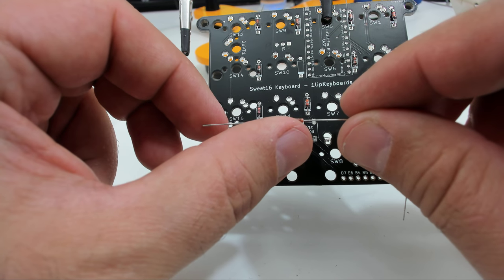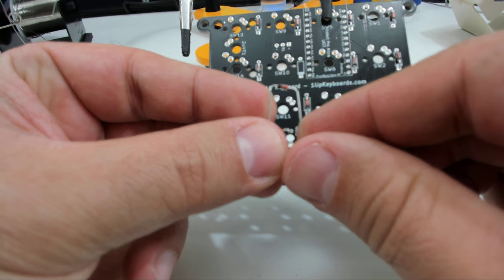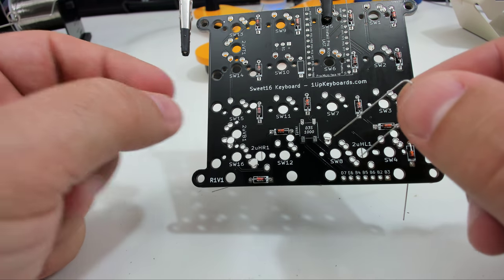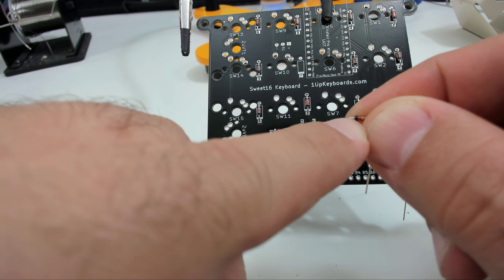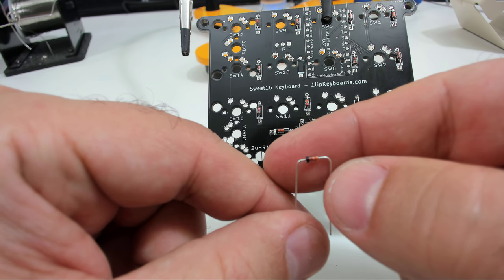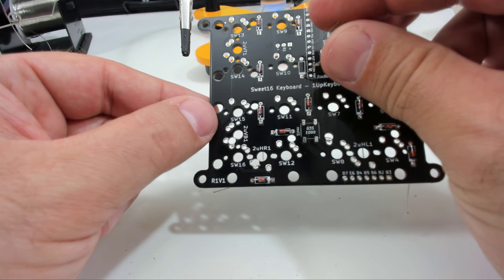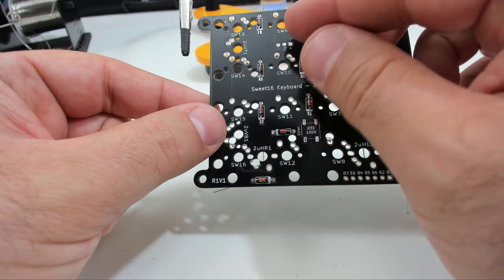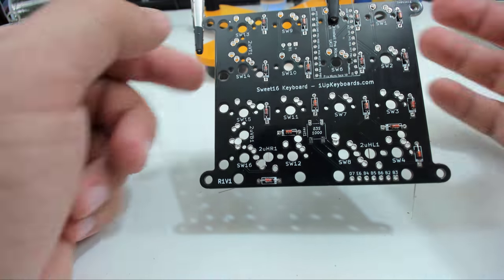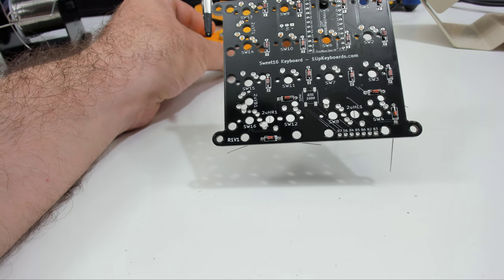Look, here's a diode, and all you do with the diode is you just bend it, and it'll just bend naturally in its own way. You see, it just happened to bend at exactly the right sort of angles there. So all I'm going to do now is take this. You see the black line here at this end? Oh, you can't see it unless my finger's behind it. There's the black line. So I'm just going to line up that black line with the thick line on the bottom of the Sweet 16 here. And just like this, I'm just going to slot that puppy right in there. Seat it nice down tightly and bend it into place. That's it. I've already put the others where they ought to go, so I'm going to just start soldering this thing right away.